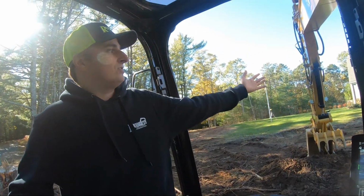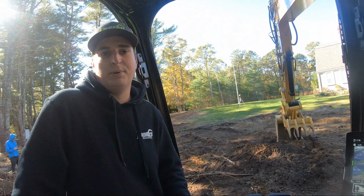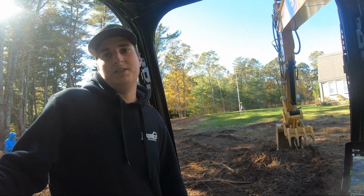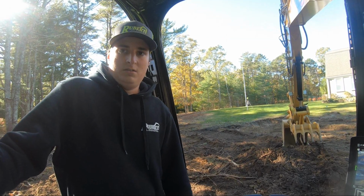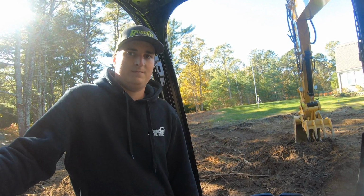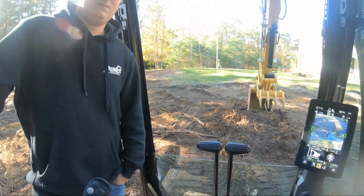It could be anything on site. It could be, you know, that stone wall in front of us you could use as a touch point. If you're digging a cellar hole, it could be the hub that the engineer places. It really can be anything as a touch point. It's really just a point of reference so the machine can differentiate the height, because it doesn't know, like I said, where it's sitting. Right. I remember a guy jumping in the machine and moving it and everybody being upset because they're like, oh, no. Yeah. You didn't touch it, or you moved it. Now we got to reset it and touch it. So you have to remember that when you're going to move your tracks or your position.